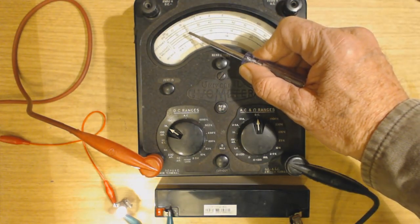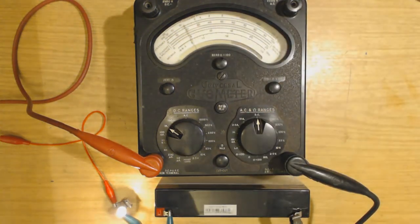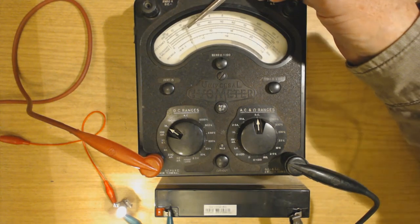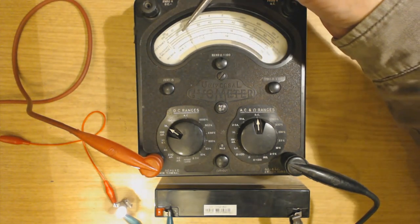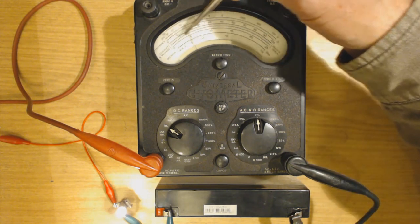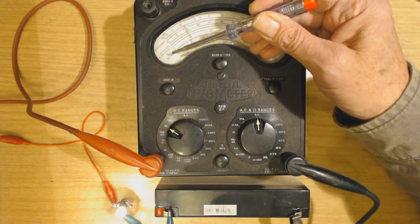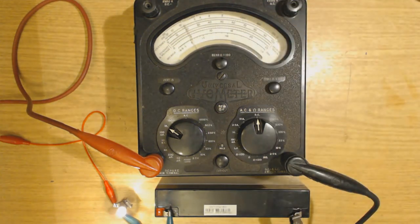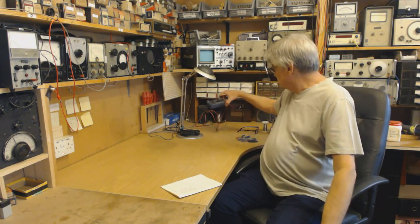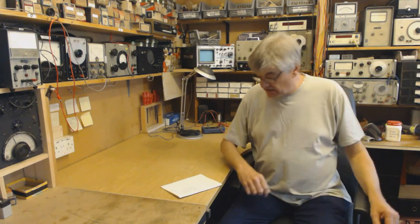That says 20 there, that's 200 milliamps. You've got to get used to reading your scale, because you might think, well, is that 20 amps? Well, no, hardly. Is it 20 milliamps? No. Have a look at your scale. You see, that is 0 to 100. All right. It says resistance and current and voltage. So it's 0 to 100. There's also the later type of meter I've covered in that, the multimeter, various things like that.